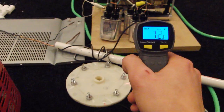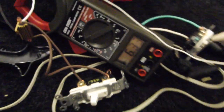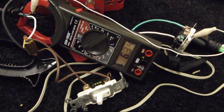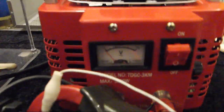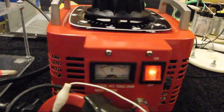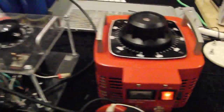Our maximum peak was only 6.3 amps. If I do a peak reading on this thing at 120 volts, I can actually get up to 80 amps being read on it. Our variac did work. As you can see, it has a switch that lights up and a little voltmeter that tells me how many volts I'm pulling, but there's no ammeter like on my previous variac — I added one to that. So we'll eventually have to add an ammeter to this variac too.